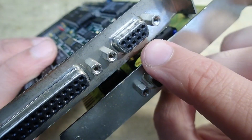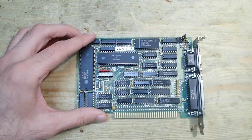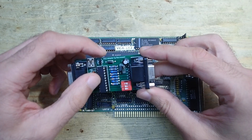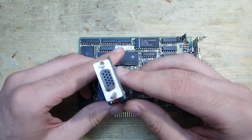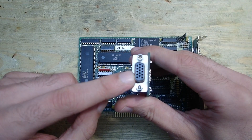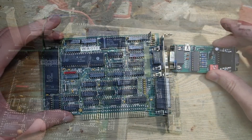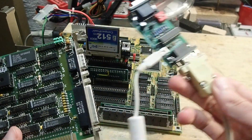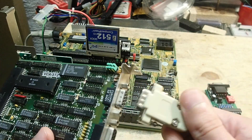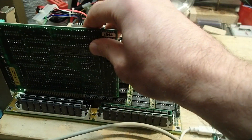For comparison, this is a standard 15-pin VGA connector — obviously not compatible. Due to very limited space in my workshop, I don't have a Hercules, CGA, or EGA monitor, so how am I going to test this card? Well, if you follow my channel, you'll remember my MCA adapter. With this adapter you can connect a 9-pin digital video signal to a 15-pin analog VGA monitor that supports frequencies down to 15 kHz. The adapter can be plugged between the ET1000 and a VGA monitor. I'll put the link to the MCA adapter videos in the description — this project is open source and you can build such an adapter cheaply yourself.